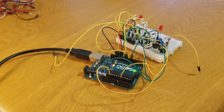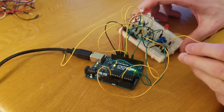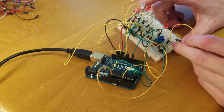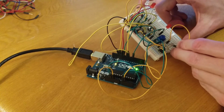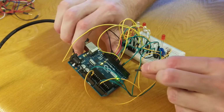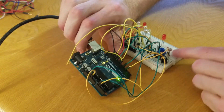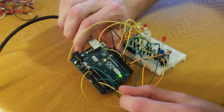All right, my video cut out on me as I was describing this, so we will catch back up from where the previous video stopped. We were connecting a digital pin line. This line is going to go from underneath the resistor, which is on line 27 over here, and the annotated image shows digital pin 10. I already have something in 10, so I'm going to put this one in 4. So my digital pin for this speaker line is going to go to 4, and then my analog line over here is going to go to A1.